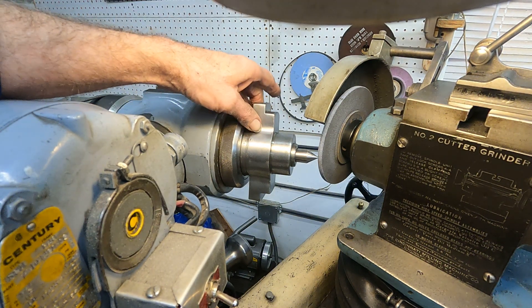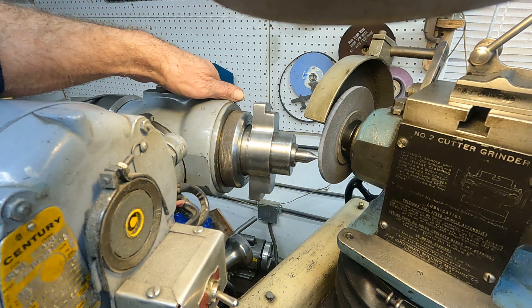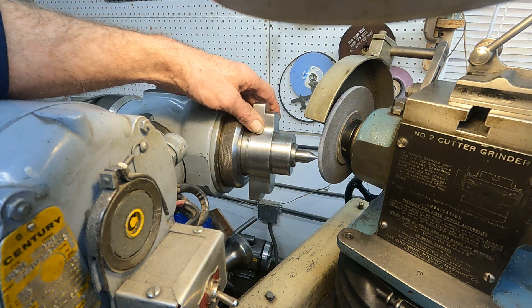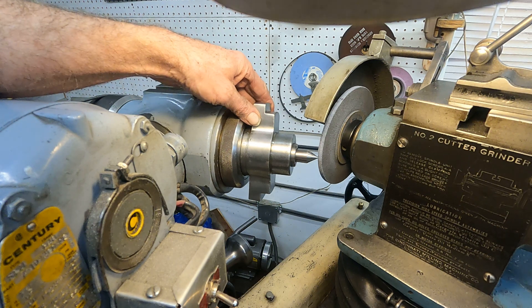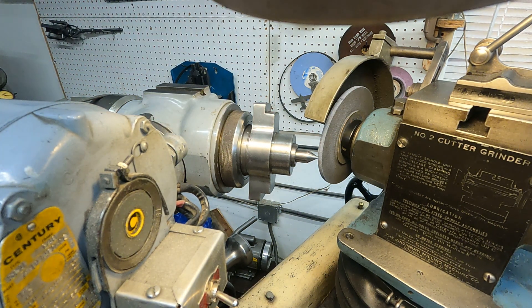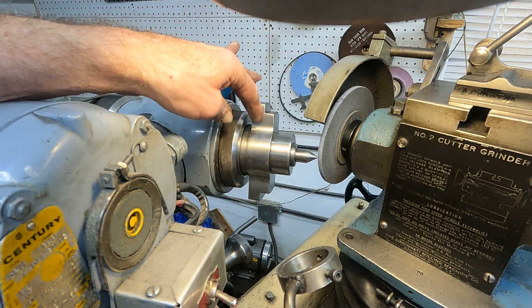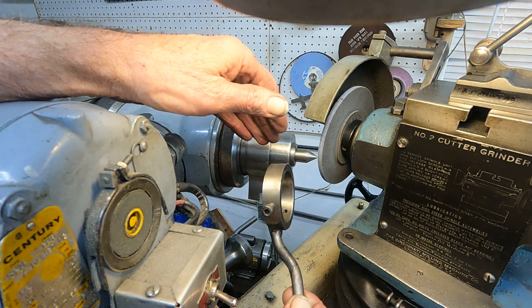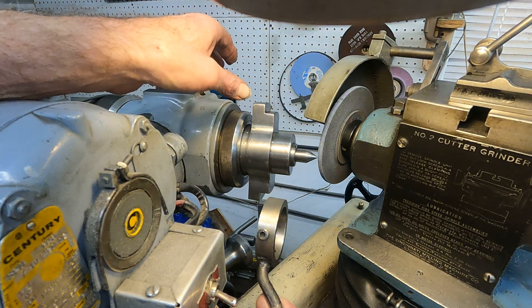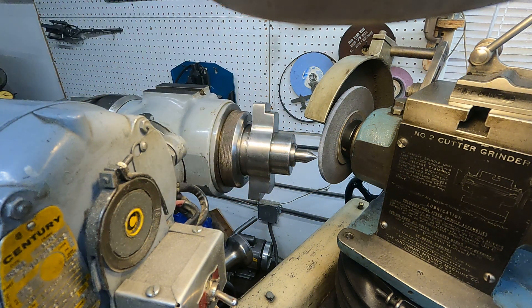I got the Morse Taper 4 adapter in the motorized workhead here — I decided that's a good place for it. I can use it to grind between centers and even motorized by using homemade grinding dogs, sort of like this. They don't have to be heavy. I can use this one just by bending it so it'll contact an ear. I've been using this by grinding a center in the lathe chuck on the other end, but this is just a better way to do it. So I'm going to go ahead and grind this in and get the workhead running.